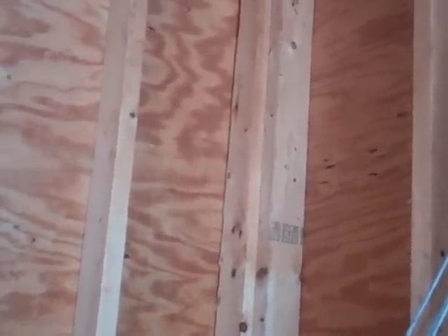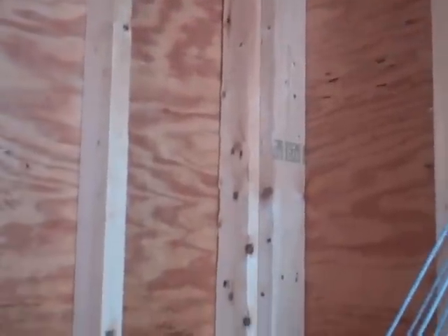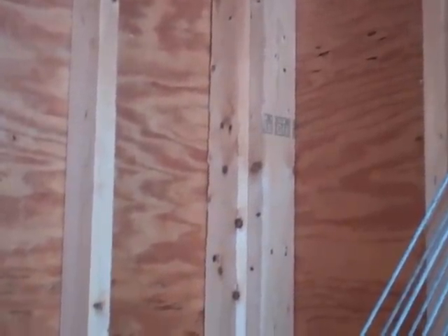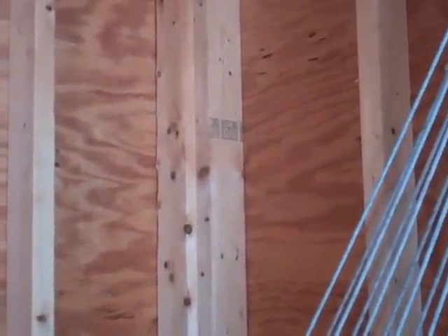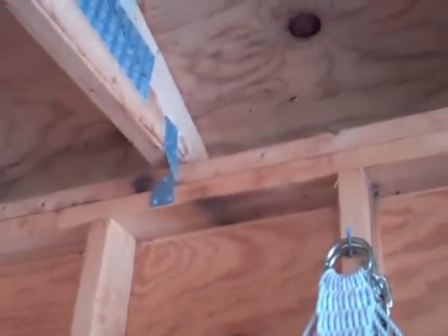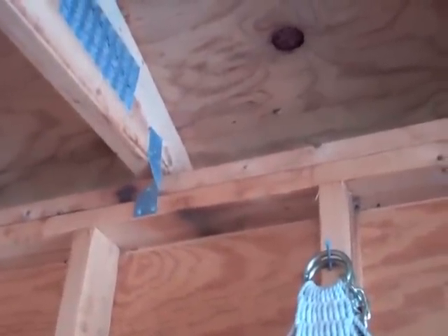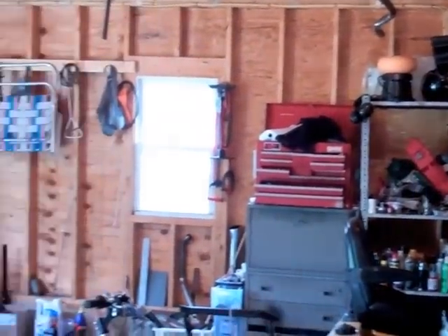Here are my corners — as you can see, I have overbuilt them, as a lot of carpenters have pointed out. I only needed two 2x4s; mine have four. And those are hurricane ties right there — those tie down the trusses. Although the trusses are nailed down, they will require that by code.